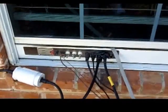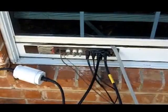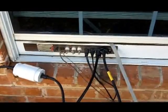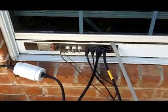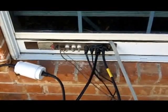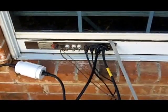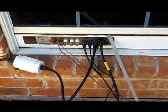Let's start with this little panel here. This was the simplest way that I could find to get the cables into the house. It's just an MFJ pass-through panel, and as you can see the coaxes come in on the outside of this panel, which is grounded. The panel itself is grounded to the ground rod. On the other side of the window inside the house, you can just connect up your coax to it and run it to either your antenna switch or directly to whatever equipment.